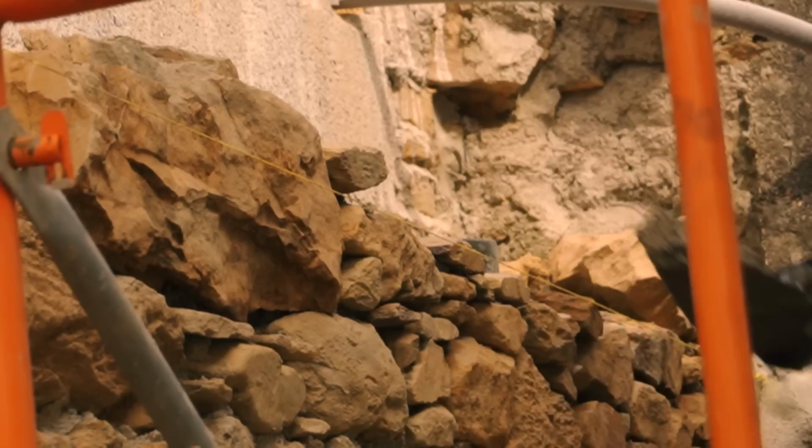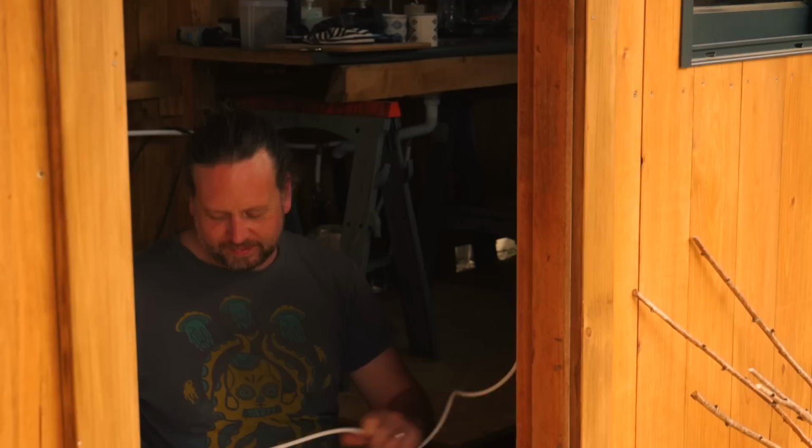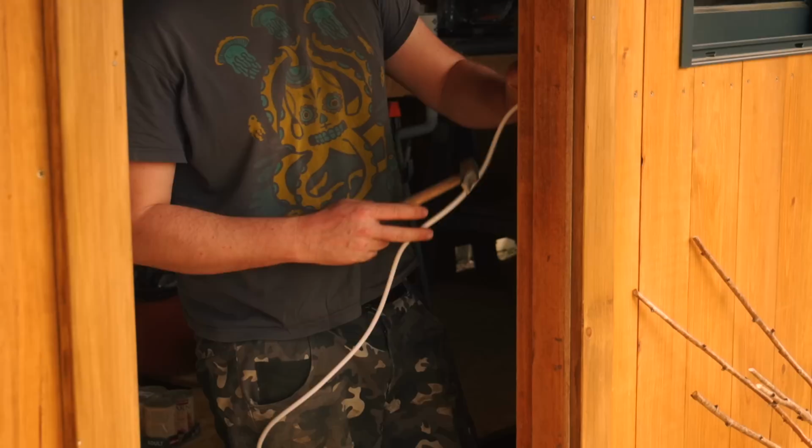Be aware that I am making this up as I go along. It might not work, but it will work. Or we'll be having somebody checking it later. This is how you need to do it. You actually should do it. With lighting circuits, you can put all the junctions by the switches, or by the light switches, or even somewhere completely different. And I haven't decided yet where those junctions are going to be. I think they're gonna be at the light switch.